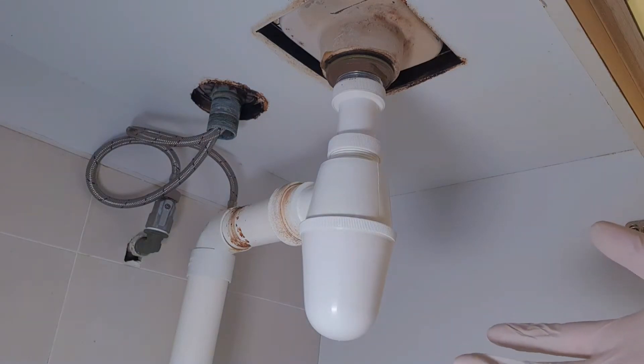As you can see, the silicone is put on the outer part of the sink all around, and that's not the right way to do it. What you want is for the silicone to be between the sink and the countertop — it would act like a glue. Just gluing the perimeter doesn't work, and as you can see, the sink would rotate around its base, and because of that, water would get in and bad things would start happening.